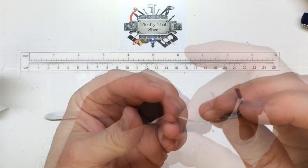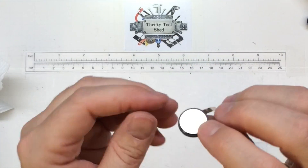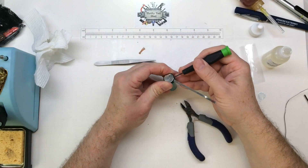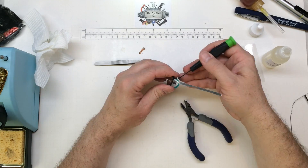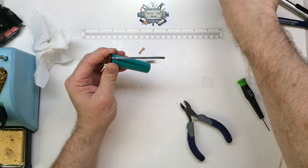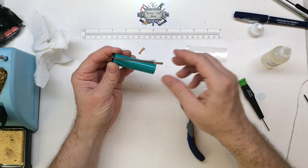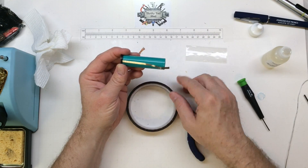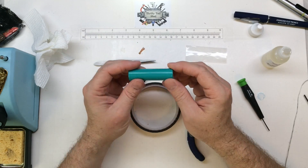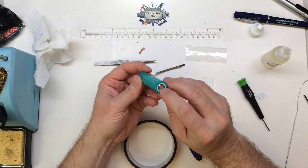Now we've got this turned straight down — that'll be the minus — and we'll take the plus through the side. Our little button cell goes just like so. All we have to do now is solder it in place on the minus, roll it over, and keep it all the way to the plus, keeping it nice and neat. We'll put the shrink wrap tube that came with it over everything, possibly add more, plus some Kapton tape to insulate where the positive runs up. I'll scratch the surfaces with some emery cloth to prep them for soldering.